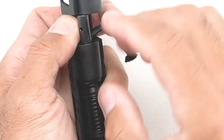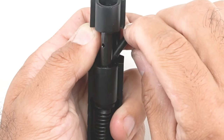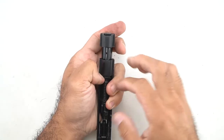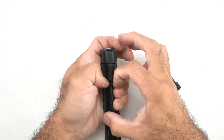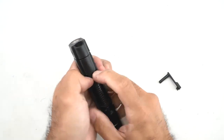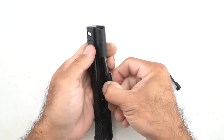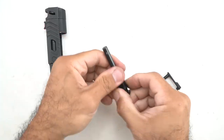From there, I'll use my thumb to grab onto that lip. Now I have a hold of the recoil spring plug. I'm going to pull it back while depressing the recoil spring, compress it all the way, angle it, and then pull out. Be careful with this because it is spring-loaded — it could fly out of your hand.